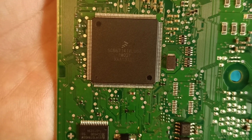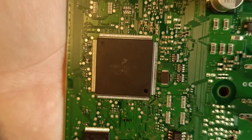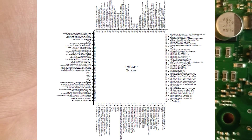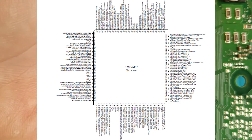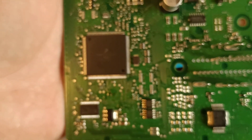Let me show you the mask of this MCU. The mask is 1M03Y — you'll find it also in the programmer. I'll show you later: it is the MPC5607B, and this is the mask. As I said, you can find a diagram on Xprog, but it is totally different — the connections are not like this one, the board is different.